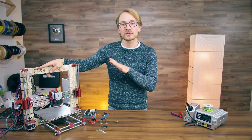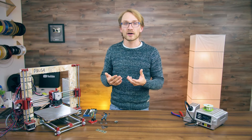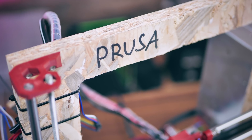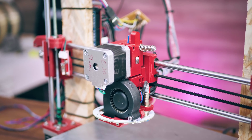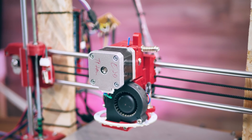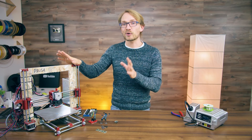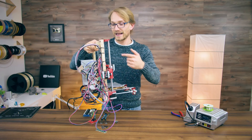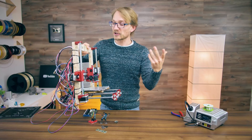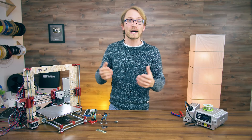This is Dolly - it's my attempt at building an i3 for bottom dollar, and you can definitely tell by all the corners that have been cut, or those that have just been cut square because that's less work. I love these cheap DIY printers that are based on the most commonly available parts, because they are great platforms for experimenting and learning about what makes these things tick. Most importantly for what we're going to do today, Dolly uses a bog-standard import RAMPS 1.4 and an Arduino 2560 clone, which is pretty much the worst hardware combination you could use, but it's what almost all other 8-bit boards are based on, so this guide is also going to work for all those printers that use a vaguely similar 8-bit board.